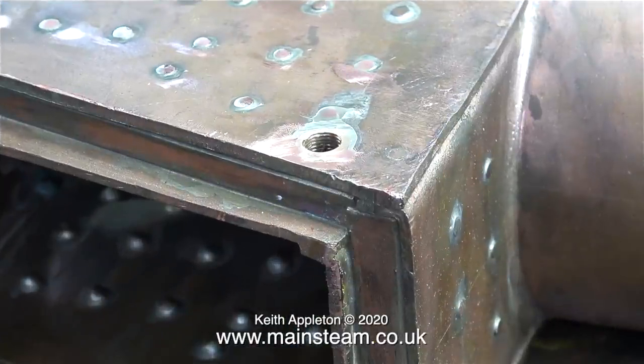When I first tried to fit this boiler into the frames, very early on before I even started making the video, it wouldn't fit — the two blow-down bushes were sticking out a little bit too far. Just enough to make it so the boiler would not fit in the frames. A simple and gentle solution was to use my Proxxon angle grinder fitted with its flapper wheel to very gently remove the excess part of the flange. Now the boiler fits in the frames, but the ash pan is wrong.